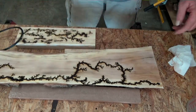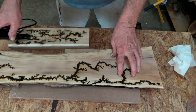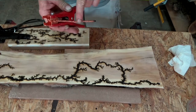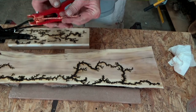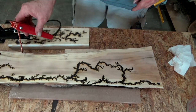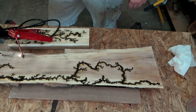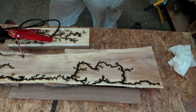Now we're going to work away this way. Just open the probe there. Like I said, this is just three strands of 12 gauge wire that I twisted around itself really, really tight. Then I put it on my grinder and made a little point just to help it connect. There we go, look at that — it's moving. Wood's drying out a little bit, but I want that vein to get burned in so it's going to stay on it.